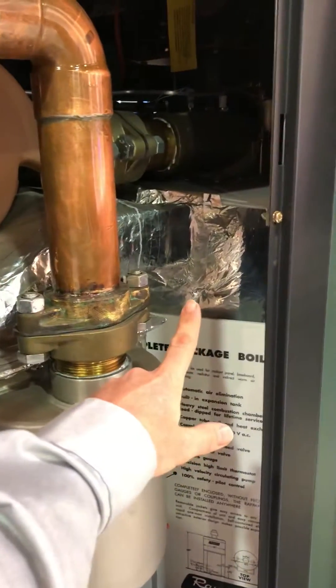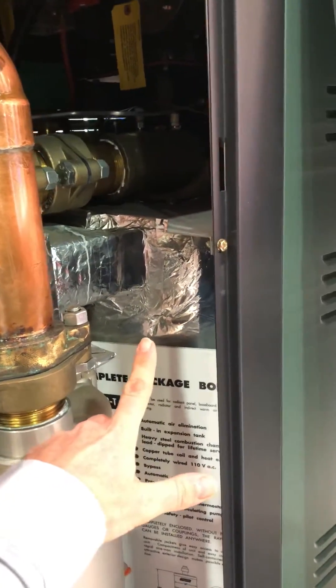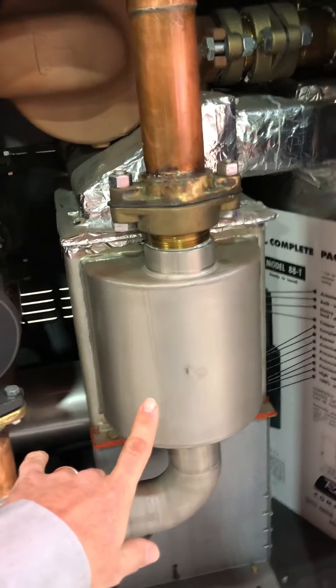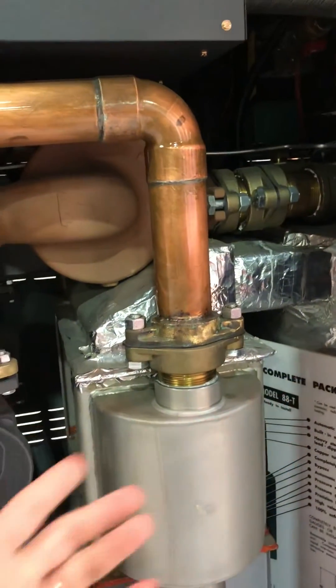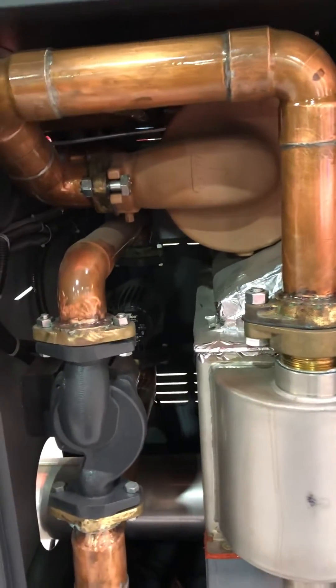In the middle, the main central part of the boiler, we have a copper primary heat exchanger. Right here you can see we have a stainless steel secondary heat exchanger. We have a main pump pumping through the primary copper heat exchanger to make sure we have adequate flow at all times, because in a forced circulation boiler you have to do that — otherwise you scale the tubes up and it gets destroyed.